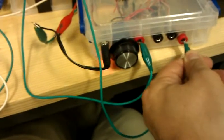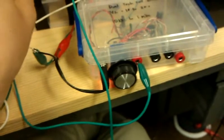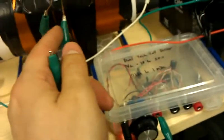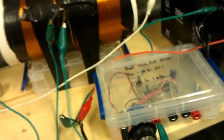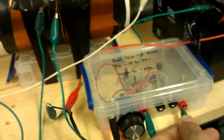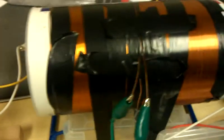One thing I wanted to try was driving both halves from the same signal. That does not work — you actually have to have the 180 degree shifted signal. You could ground one side too and it would just generate voltage on that end at resonance, but the best way to do it is to use the balanced Tesla coil approach.